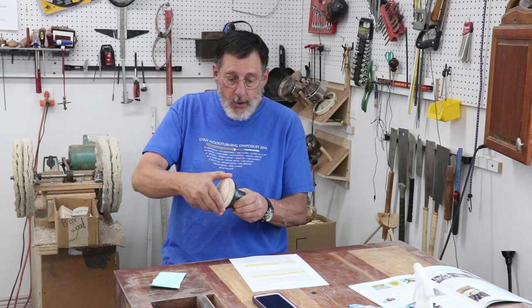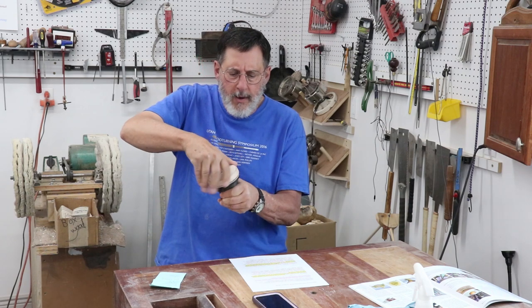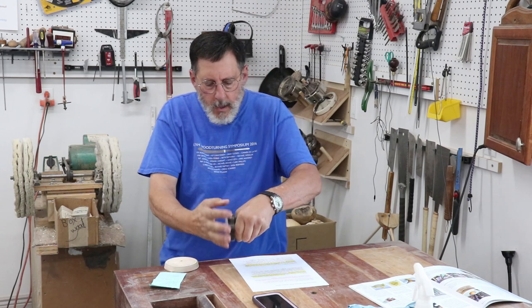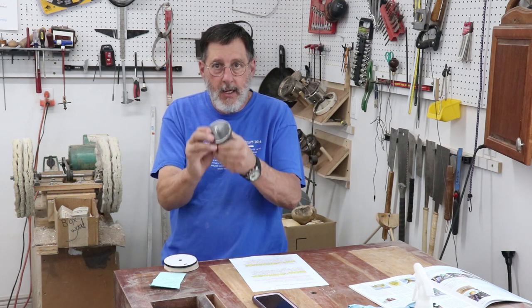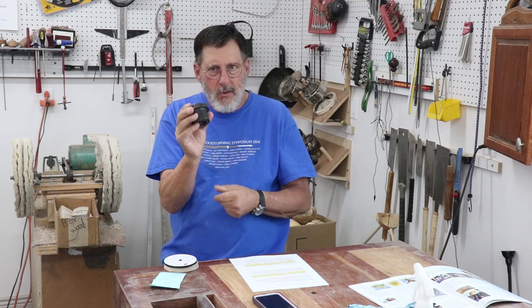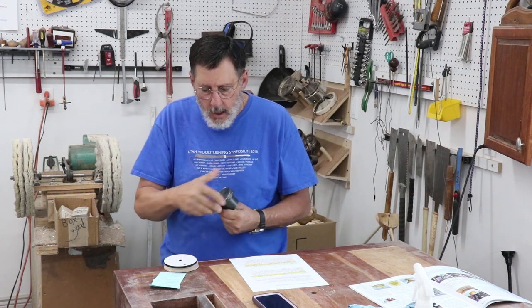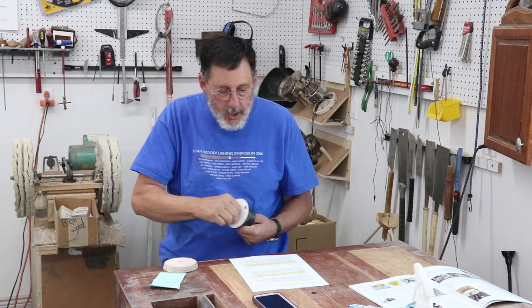It's a dedicated screw chuck. Well, I might as well just show that to you. I've got a little waste block on that. I think I was using that for a drive center, a drive block. I've also got a little spacer that I typically put on, but there is the dedicated screw chuck. It's worth, I think it was $45 or something. It's really handy. It's all set up. You can put that on your lathe spindle, and it's a quick way to start a project.